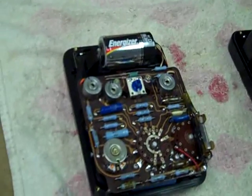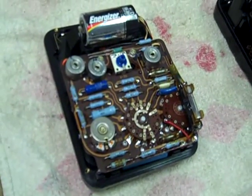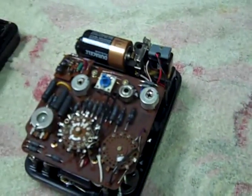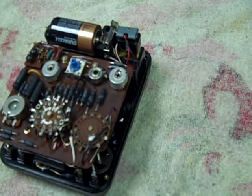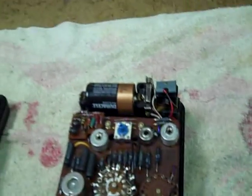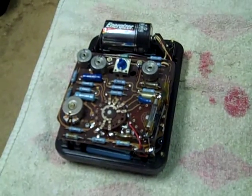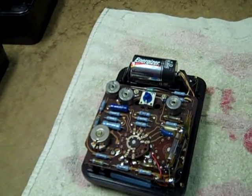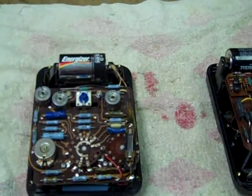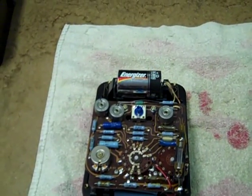The 270, like most of the old 260s, uses four AA batteries for the Rx10,000 ohms range, and the 6P uses a 9-volt battery for that. I usually prefer AA batteries, but in the case of a VOM like this, I'm going to go with the 9-volt battery. When you're checking resistance, you don't use the Rx10k range very often, so you're more likely to forget the batteries are there and they'll get corroded.